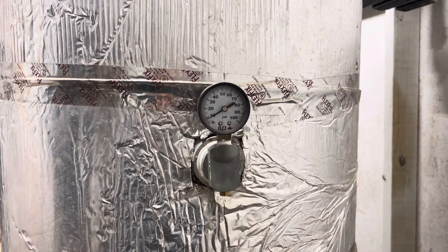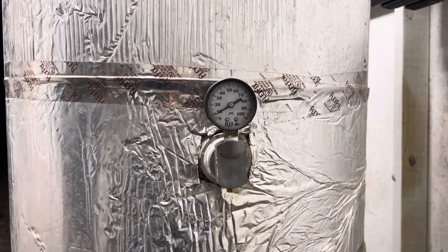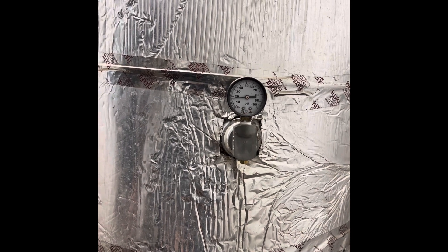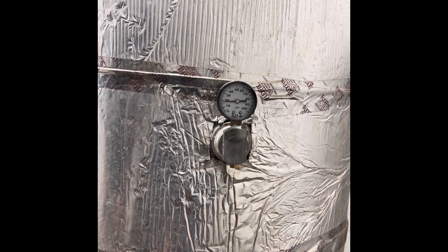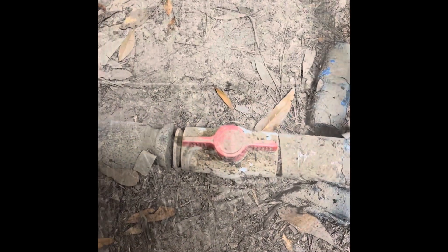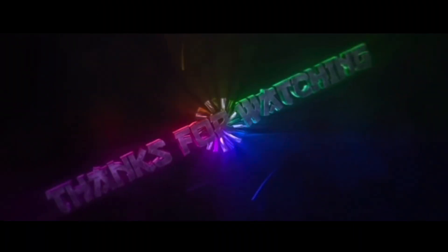The tank is refilling — I just cut the breaker on. You can hear the air bleeding out until it reaches pressure on that gauge, then it's going to cut off. Normally half of the tank is water and half is air, so the air compresses the water to push the water towards your house. I opened the valve back to the house. Hopefully this video was helpful — check for leaks — no leak!